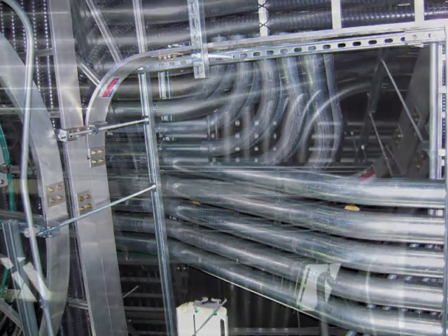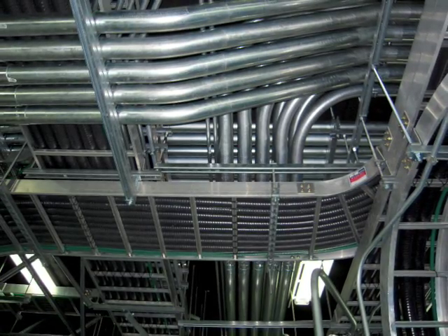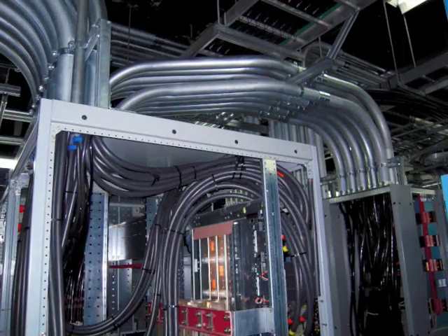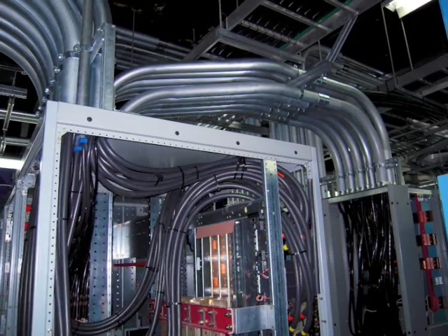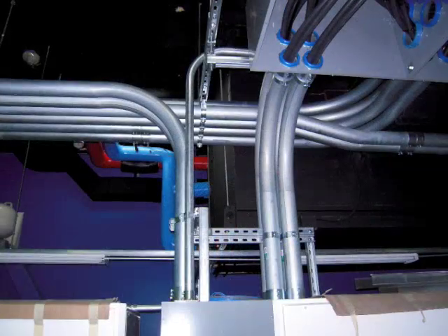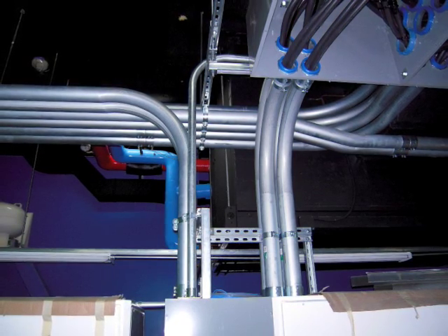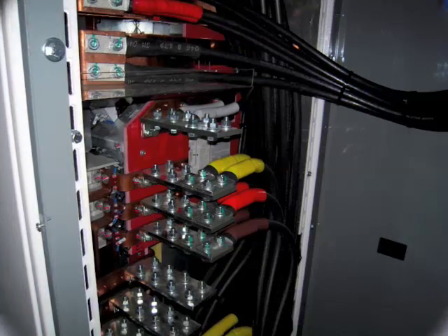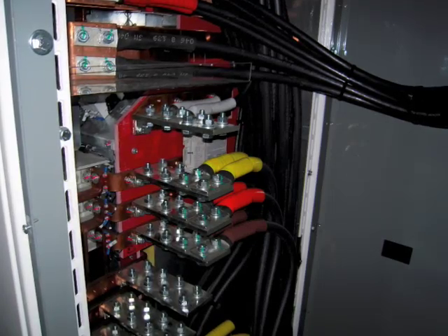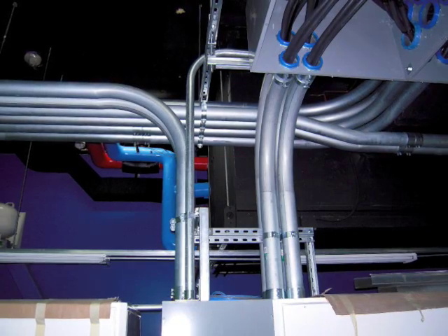Interconnectivity of all the hardware takes the most time and starts with the layout and design of the conduit system needed for the wire. In our case, we utilized thousands of feet of EMT conduit to tie all the components together. This includes conduit for getting 480-volt power to each of the UPS modules, 480-volt power from each of the UPS modules to the bypass cabinet, DC power from the battery system to each UPS module, and finally getting the UPS power from the bypass cabinet to the output distribution gear, and then to the actual panels that will feed the floor.